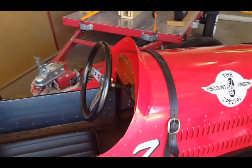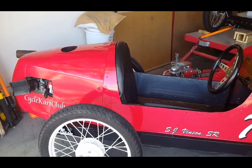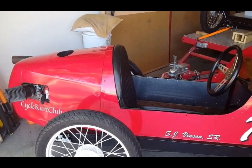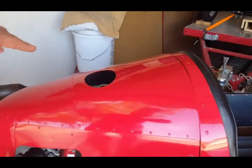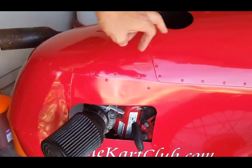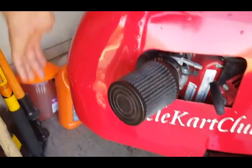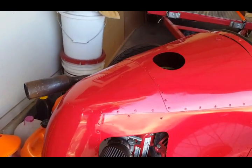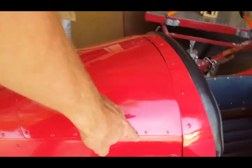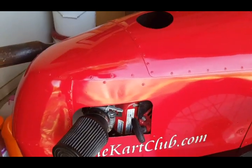This has been re-bodied. I rebuilt the entire tail section — bought an English wheel and taught myself how to use it. It's harder than it looks on the internet. I thought I'd get the top piece in one or two panels, but there are actually eight panels that make up the bottom and ten panels altogether for the whole tail section, all riveted together. You could have TIG welded it all, but I think this is fine.